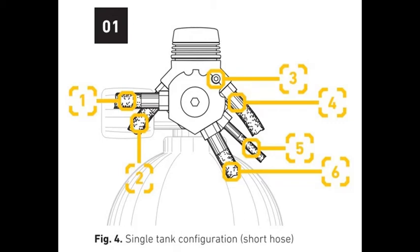We are now going to discuss various applications that the XDeep first stage regulator can be used for. The following drawings were taken from the XDeep NX700 and LS200 regulator manual. Here is a diagram of the NX700 in a single tank configuration. Hose one is the primary regulator, which can be either a short hose or a long hose. Number two is the necklace or alternate regulator. Three is the locking bolt. In a single tank configuration, XDeep recommends locking the turret in position.